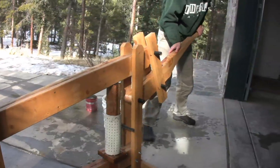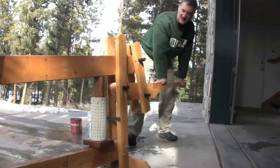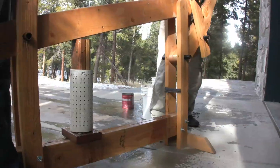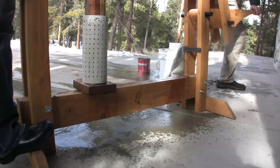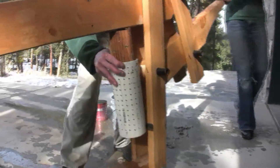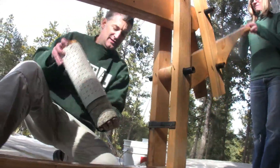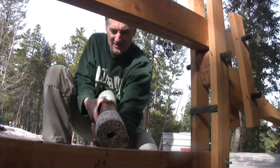The first thing I'm going to do is press the briquette down in the first position, which does the initial compaction. Then I'll lift it up and slide the platform down into the final position. You can see the water exiting the cylinder. Now I'll put it on the ejection lip and slowly come down. You can see the briquettes exiting the bottom of the cylinder. It's as simple as that — you can see two briquettes right there, separated by the ring.